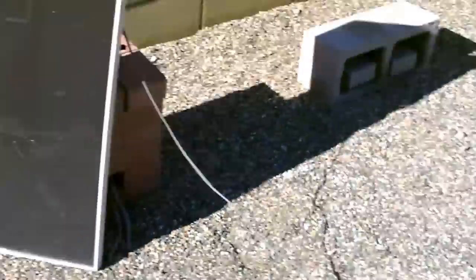Got the solar panel hooked up right now — that's more than big enough for this. That's just a 4-watt fan and that's a 15-watt panel, but that's what I had. That's a 2-watt panel right there — that'll run it at half speed, or 40 CFM. So even that works pretty good.